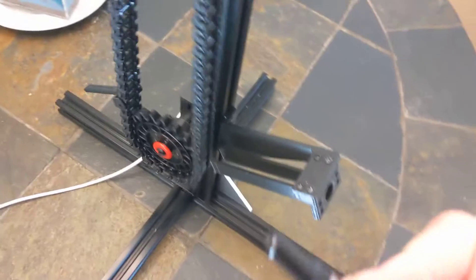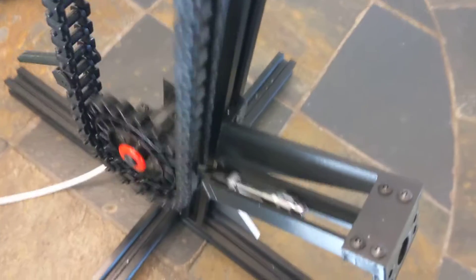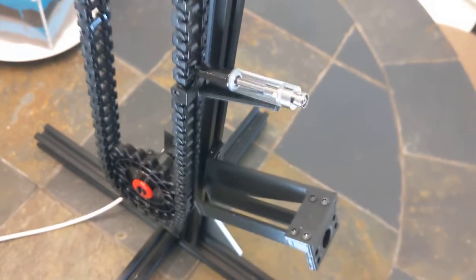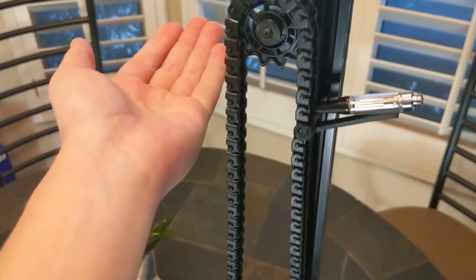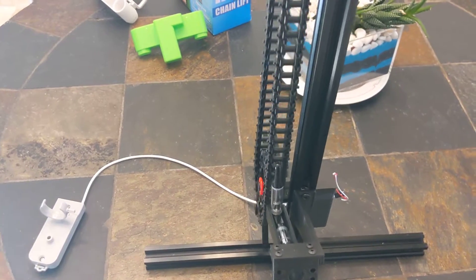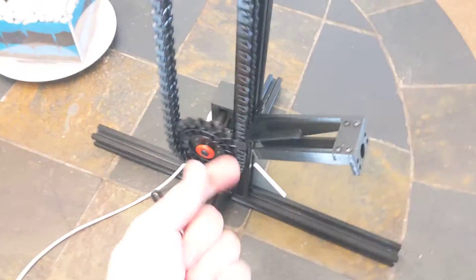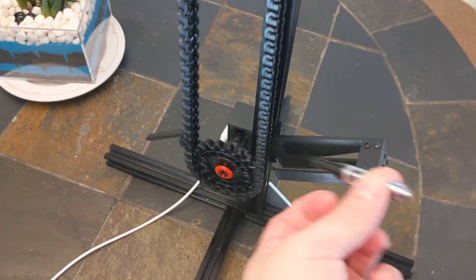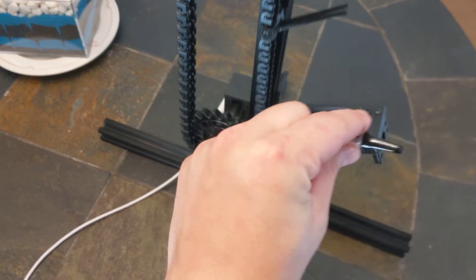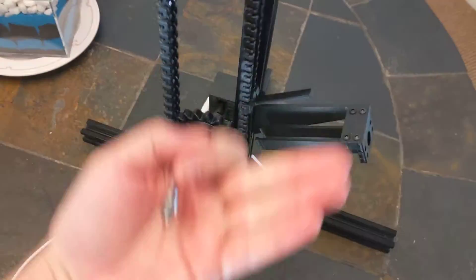Another issue is that sometimes the tips are thin enough that they fit right through the end stop of the lift cue — just like that. It only works correctly if there's one in the chute. If there's another one backed up behind it, it pushes hard enough to lift it up, which is interesting but not ideal long term because two come out, they could get stuck or fly off — bad for business. I'm going to play with the distance of this end stop, maybe assume all of them go through that way, and check if ones that go backwards still have enough distance for the scoop to get underneath and lift properly.